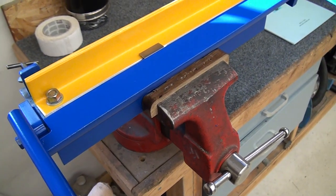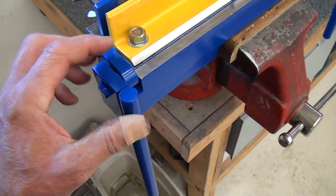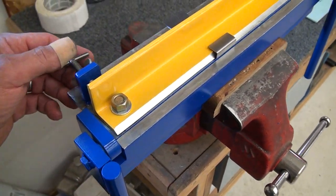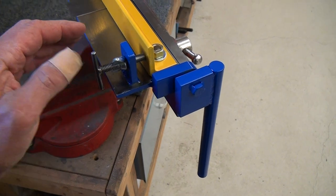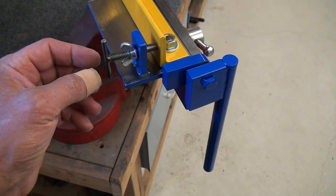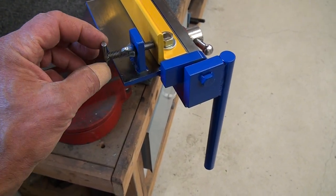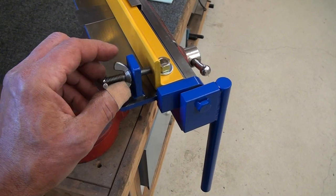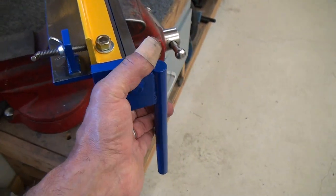Now this little brake — look at it, it's real simple. It's made out of pretty much half inch bar, about an inch and a half wide, and all the pieces are made out of pretty much the same stock: three inch angle here, and some other really cool little pieces back here that help adjust the bar in and out and keep it from sliding back and forth. These nuts hold it down, and these will definitely help as well. I just made these adjusting nuts out of small thread stock and welded on some little quarter inch rod to it. And there's a wing nut that they specified in the plans to lock that down, so once you have the measurement set you don't have to worry about bumping it.